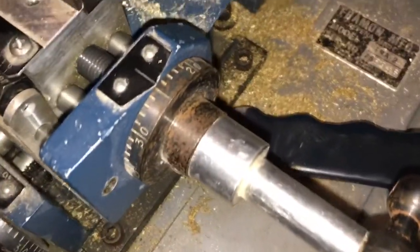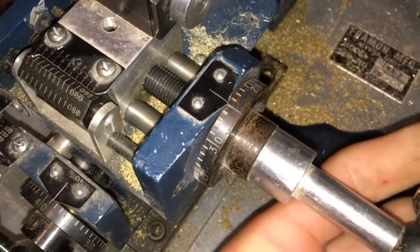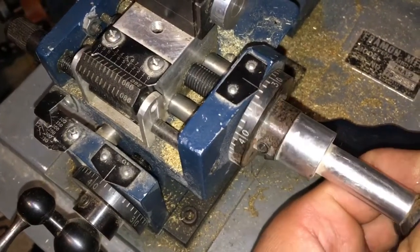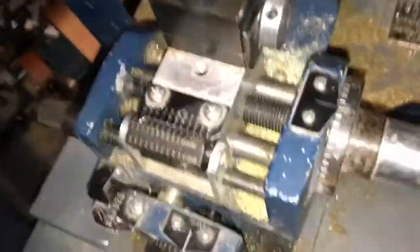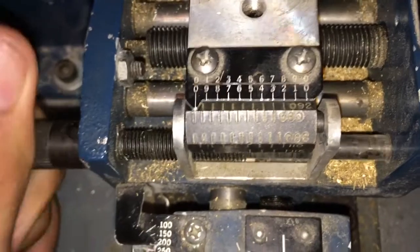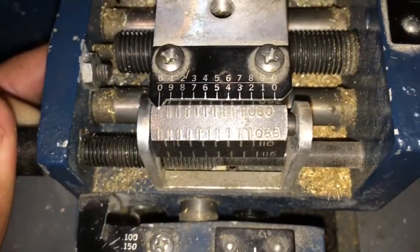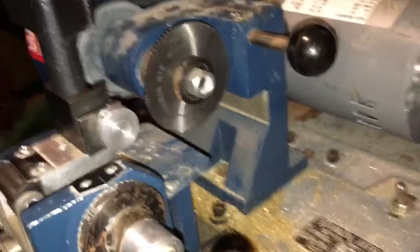So then we have to roll it 0.60 inches further. So there's 50 right there, and then 5 and 10, there's 60. So that is our cut 8 essentially, or 1. I forget, but now we index our spacing block number 3 to this position right here, spacing increment 0.08. Okay, so now it's set up and ready to cut.